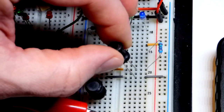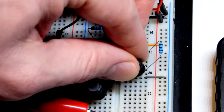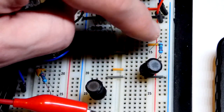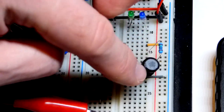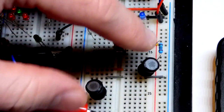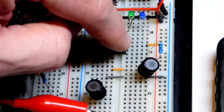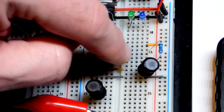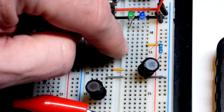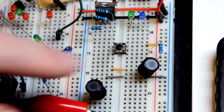That resistor wasn't even connected to the inductor — it wasn't letting any current go through. Now we're going to add the inductor. You can see it's going to where the jumper and the resistors and the other jumper are. When I close the switch, current will go through the resistor and through the inductor. When I release the switch, it's probably going to keep current flowing a little bit, and there'll be a little spark somewhere inside the switch.